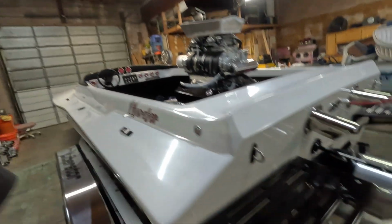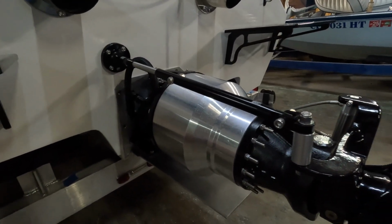We've done a ton, man. We had to put the camera down and really just go gangbusters on this thing if we were gonna make something actually happen. And with Bill flying in a little later today, truthfully, it was really time. So anyways, what have we done? The pump is in, it's sealed, it's bolted down, torqued down, the drive line's in, we've ran the fuel lines, we've ran the water lines for the most part. We've siliconed pretty much everything that needs to be siliconed. We even added a high-tech performance, or HTP, steering extension in the back because the pump is set back. Check this thing out. Boom. Look at that. It's badass.